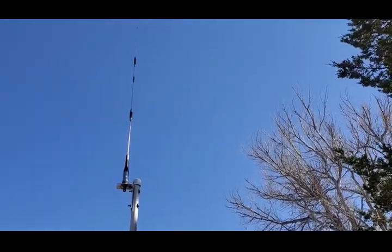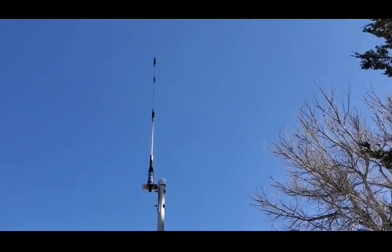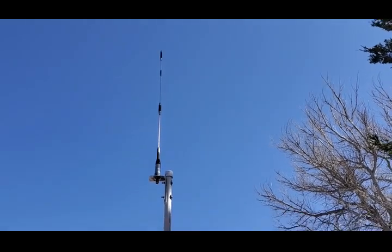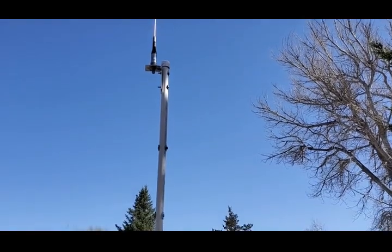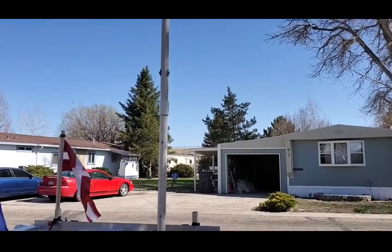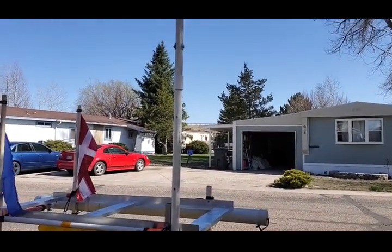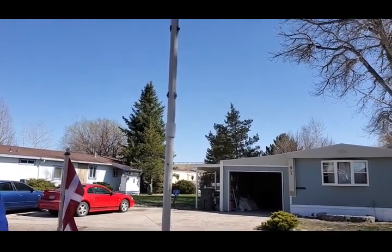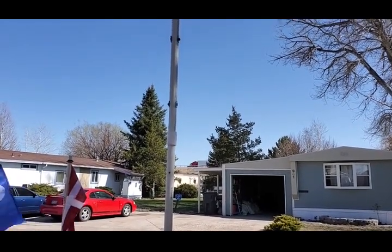So I said, why not put a mast on my trailer for my good 2 meter 70 centimeter antenna? I made a bracket — it's a bit crooked and I need to straighten it out — made out of 1 inch PVC. I have a 5 foot piece attached to the trailer and then another 3 foot piece that goes into it, guided by a dowel and a connector which isn't glued in.